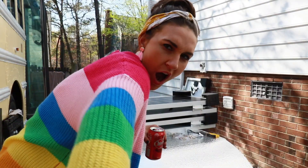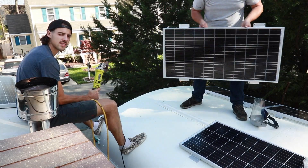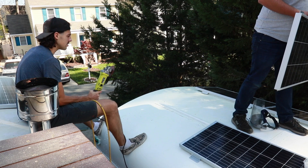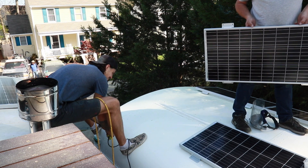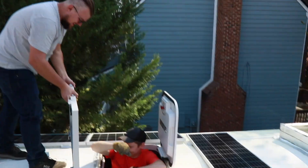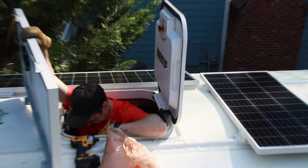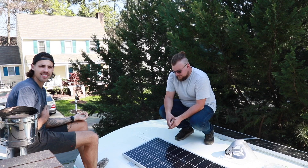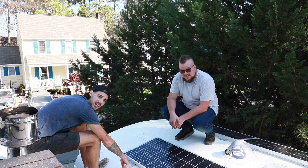Panel brackets assembled. I just finished work for the day and they're just about to start installing the solar — I can't wait. It is such an electrifying feeling, it really charges me up. I'm going to grind off a rivet so the bracket sits flush. Now is there a chance that sparks will damage it if they fly over here? Alright, the first panel — we're going to lay it down, mark the eight holes, drill through the roof, and bolt it in.